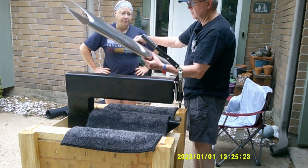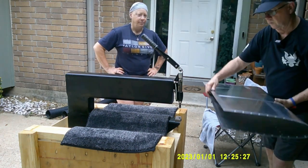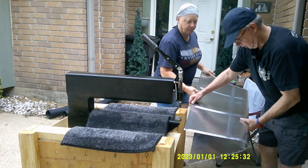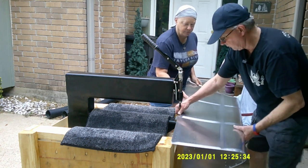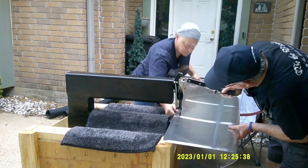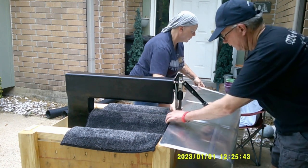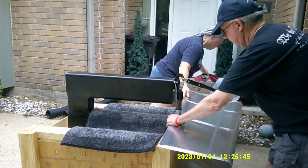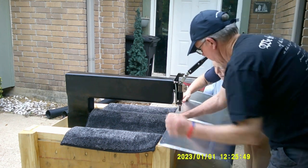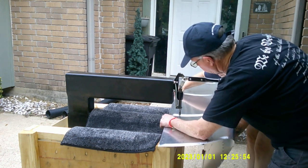You can see the marks on the aluminum where I've scuffed them with the scouring pad - I give you the part number in another video. I've also pre-marked all of the areas that have to be dimpled with a Sharpie so you don't make a mistake and dimple the wrong parts. Here we're just bending the aluminum, but you can see you have to have a fairly significant bend, and it really is a two-person job.